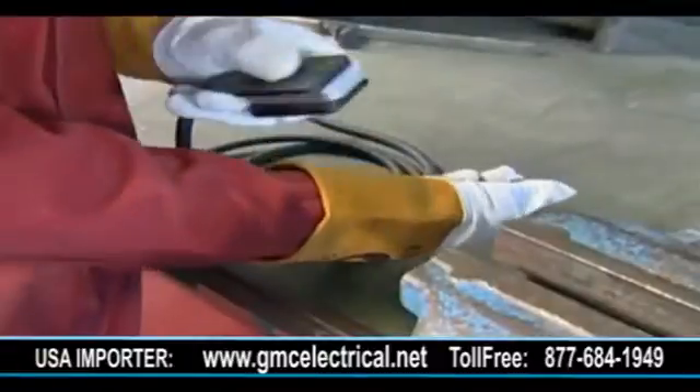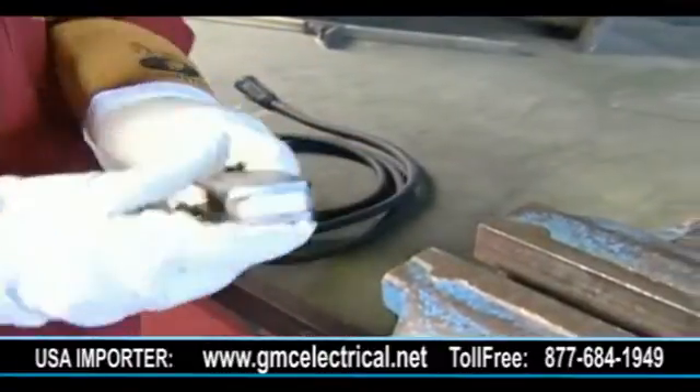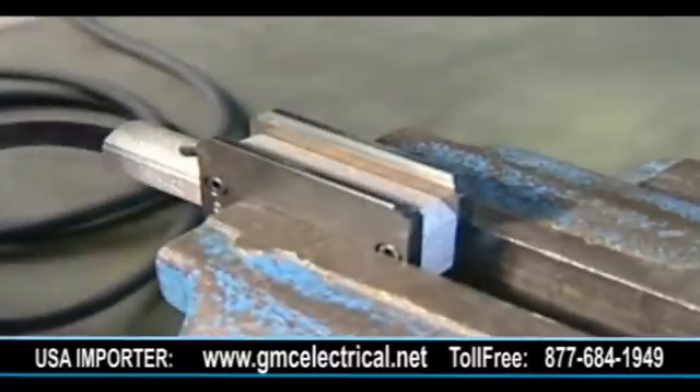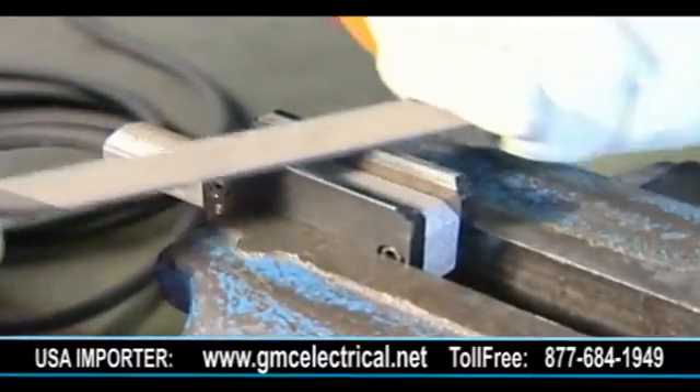The earth device requires little maintenance, provided it is kept free from moisture and metallic particles which may build up. This will decrease the continuity of the magnetic connection and result in unwanted arcing. If the contact plates become pitted, simply skim the faces with a flat hand file.